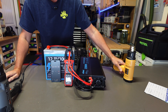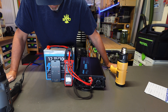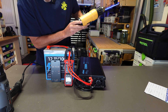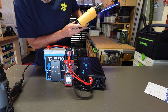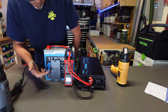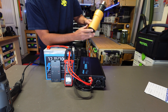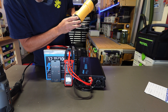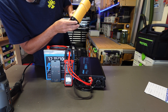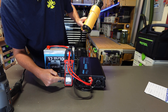Still running 170 amps and I haven't cut that timer off yet. The cables don't even really feel that warm. Just past six minutes running 170 amps. Let me see if I can crank this up anymore — there's 180 amps. Let's let it sit at 180. We're at six minutes and 40 seconds pulling 180 amps. Hit seven minutes at 180 amps. Now 197 amps... 215 amps. I'm surprised my inverter hasn't tripped off yet — we're sitting at 215 amps right now.